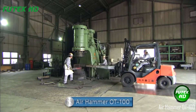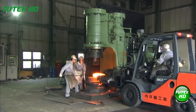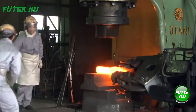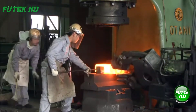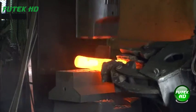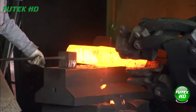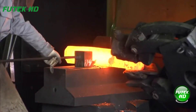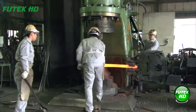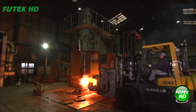The Otani Air Hammer OT-100 is a powerful double-acting air hammer designed for demanding forging tasks. It operates using a built-in compressed air piston system with power transmitted through V-belts from a motor, which drives the crankshaft to compress air. This compressed air is directed to both the top and bottom of the ram, enabling strong, controlled blows. The OT-100 features a rational valve system that optimizes air use, while blow force is enhanced by the combined action of the ram's weight, compressed air pressure, and re-expansion of the air cushion formed during the upstroke. Operators can easily adjust blow intensity and speed from weak to strong and slow to rapid blows via a special air regulator, and the large space between the rammer guide and anvil simplifies handling of larger workpieces.